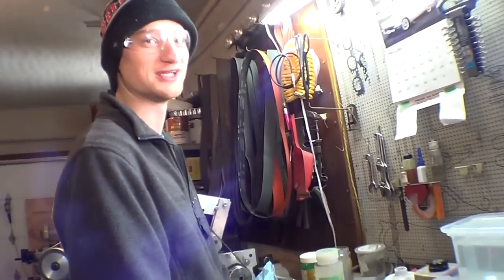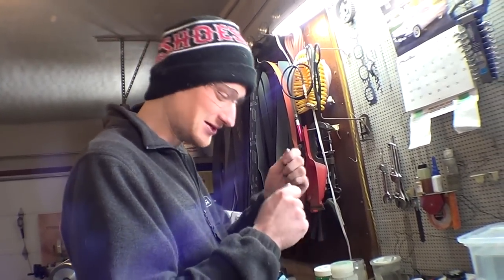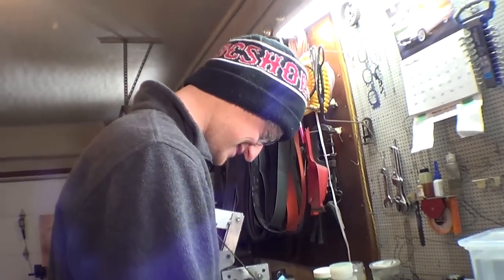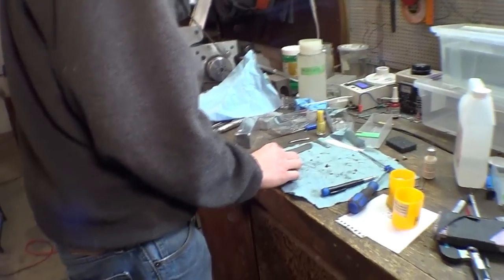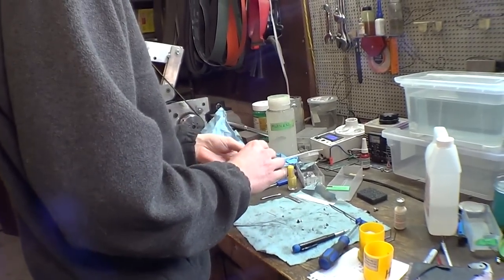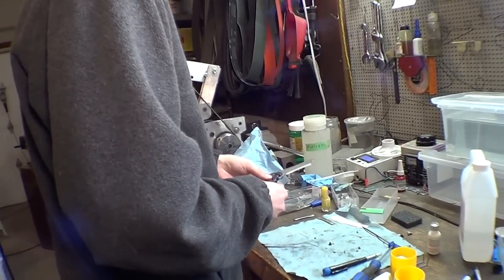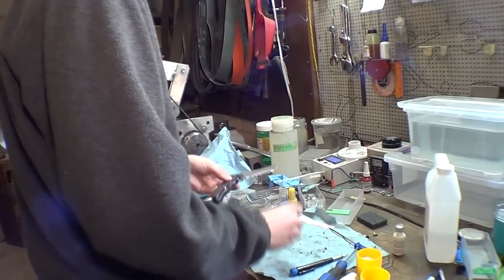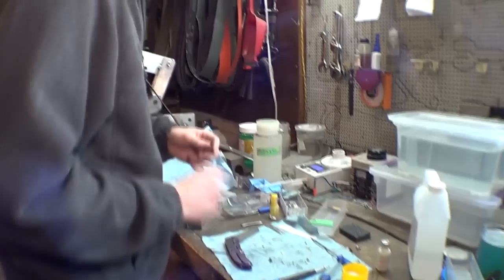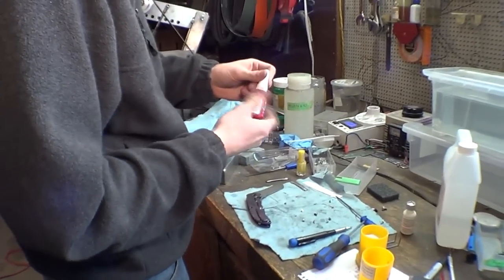Because before we'd etch it and then put it together, and it was just so horrible. You felt all the little pits. It feels like sandpaper. And no offense to other knife makers, but I've seen guys do that. And when the detent ball is scraping on a severely etched surface, it just feels horrendous. Whereas ours is like floating on magnets. Now, we did have a few that were not so good. Yeah, but we learned.